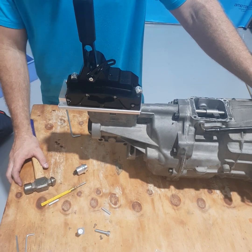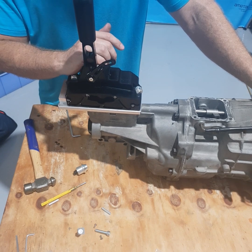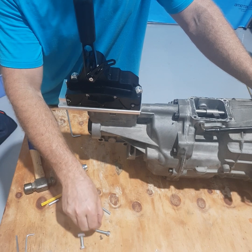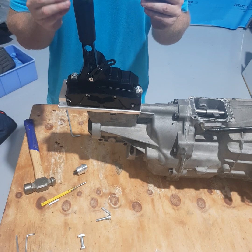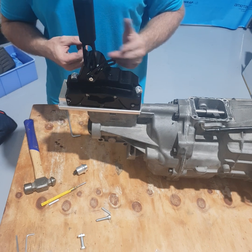That's pretty much the entire fitment. We've also got the gear indicator and position sensors that you might want to use — they bolt on the other side. Another important thing: if you don't fit the position sensor, you must fit screws into the two holes where the position sensor would go, otherwise oil is going to come out of the holes because they go right through.